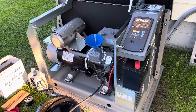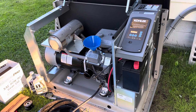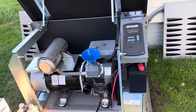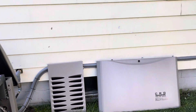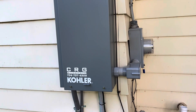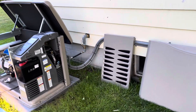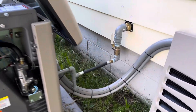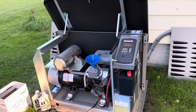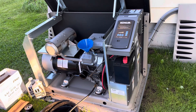We used to mess around with a little portable generator and I got tired of firing it up, getting gas, running extension cords. This wasn't cheap — we paid around $11,000 — but man, is it worth it when the power goes out. It just kicks on in a few seconds. It's got a big automatic transfer switch that ties into your meter. Ours runs off natural gas, though they can also run on propane. On natural gas it's reduced to about 12 or 13 kilowatt, not 14, but it's enough to power our whole home.